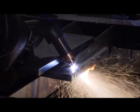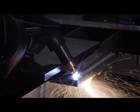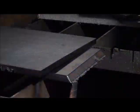If making a bevel cut, the material thickness increases proportionally with the bevel angle, which should be factored in when determining the torch travel speed and amperage output.